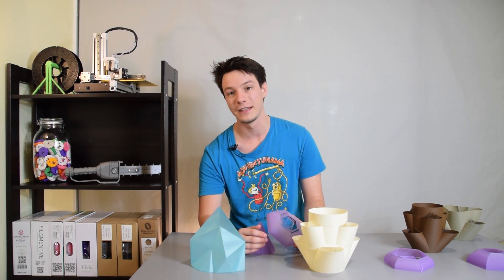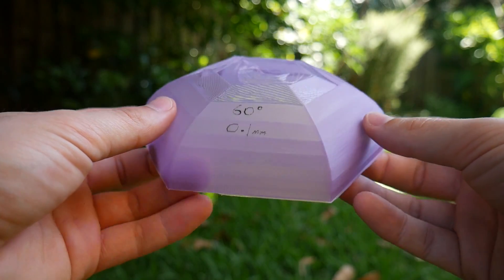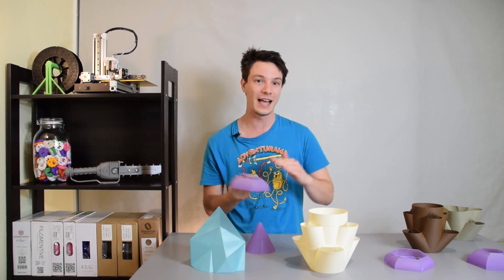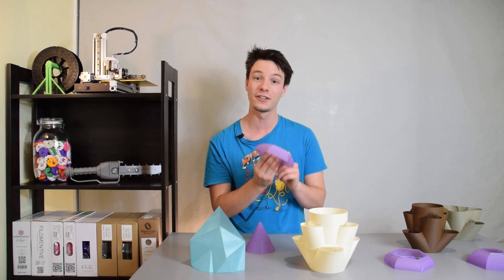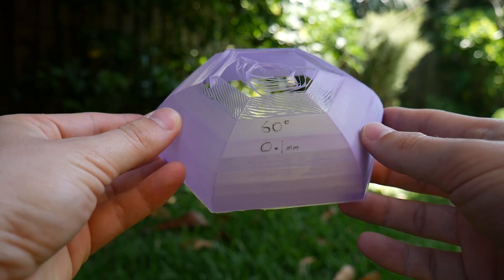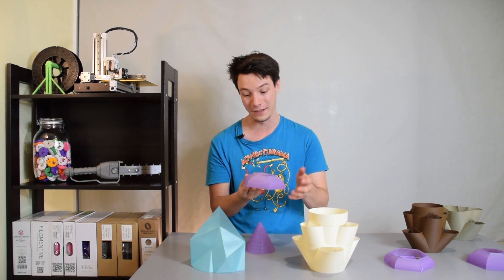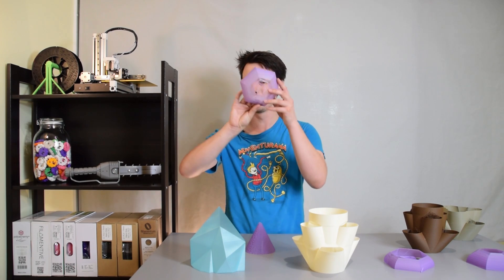Then I wanted to see what effect a lower layer height would have. I made a 0.1mm layer height test and it got up to 60 degrees, which makes sense — although Vase Mode incrementally lays plastic on top of the previous layer, it still has a certain distance between layers. In this case it's half of the 0.2mm, so it got to 60 degrees before failing. What's also interesting is the transparency of the part: as the layers get steeper they're further apart in space, so the plastic gets thinner and eventually fails. The first layers are quite opaque, but at 60 degrees it's actually pretty translucent — you can see through it pretty easily.